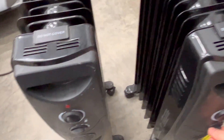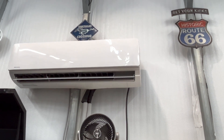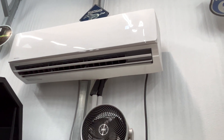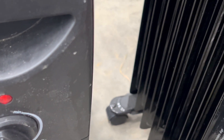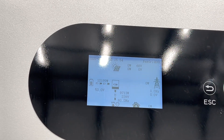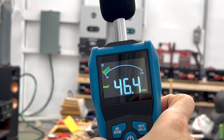I'm going to turn those off for a moment and turn on the mini split. This is a three-ton, 36,000 BTU unit — the size you'd use for a small house around 1,500 square feet or less. With the mini split running, we're a little over 7,200 watts, then I put the heaters back on high. We're now at 10,200 — it hit 10,300 for a moment. About 63 decibels a foot away, and on the other side of the room about 47 decibels.